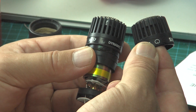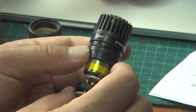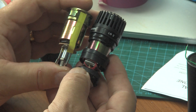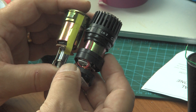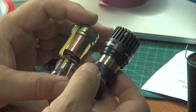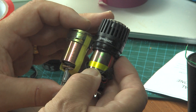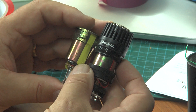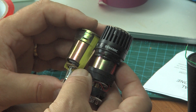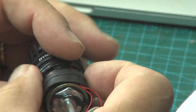The plan is to use the genuine Shure top cap for this repair. There's a risk of wrecking the replacement cap trying to get it off, but at eight quid it's not a major concern. For comparison, the Chinese replacement capsule on the right has two red wires, whereas on the Shure, one wire goes under a yellow bit of tape on each side. The rubber bung comes off to reveal a completely different internal design from the Shure.